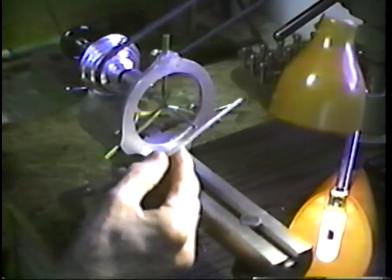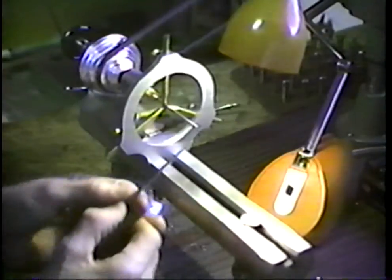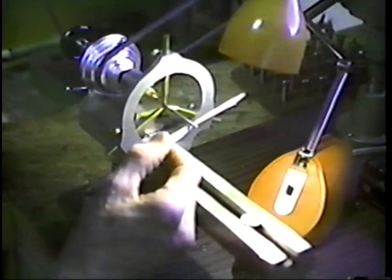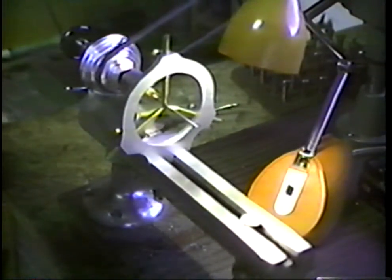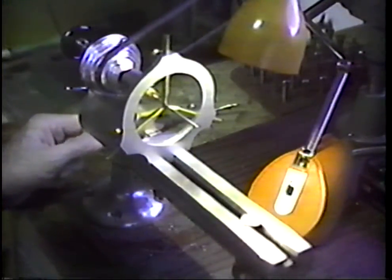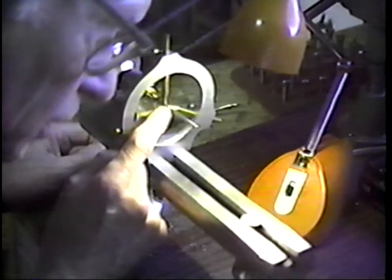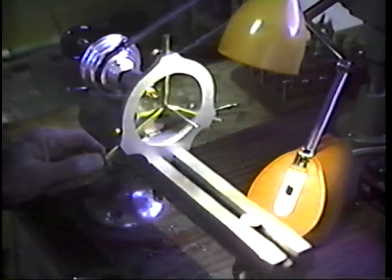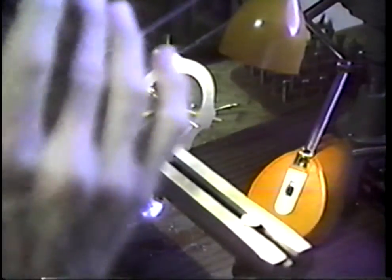and there is ever so slight tremor where this pivot is extended on out to this distance. Probably, I feel pretty sure that you can't see the tremor in that rod there, but our action now will be we will saw this off, and then we will machine it to the dimensions that we want to fit the plate, namely about 72 or 3/1000ths of an inch. Okay,